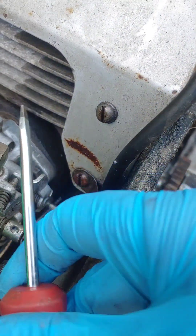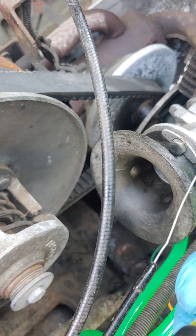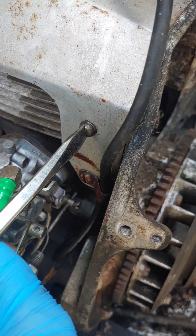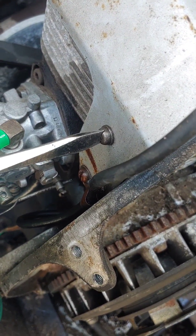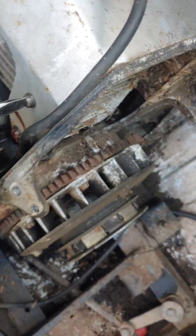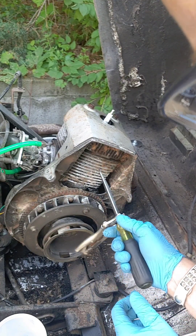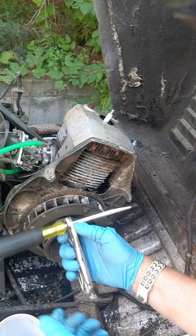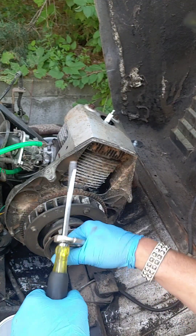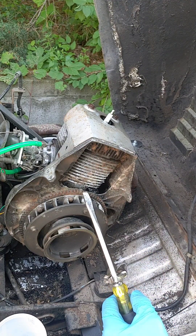When working on taking out these flat heads, don't just grab any little screwdriver you've got laying around. Get something that's substantially wide but has a narrow grab, because that screwdriver will grip a lot better if it fills the entire slot and gets all the way down in — that slot is actually kind of narrow for a flat head screw that big. Remember when I was talking about screws getting hot and seizing in? These two back here are really tight, so I need to go get a vice grip and put it on the screwdriver shaft so I have double leverage, and that way I don't round out the slots on these flat head screws.